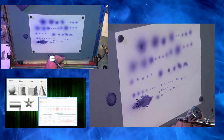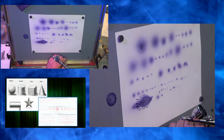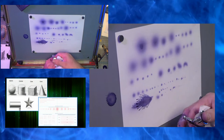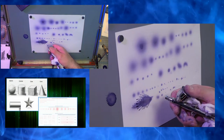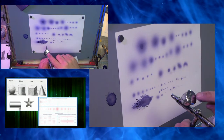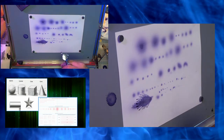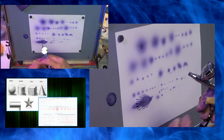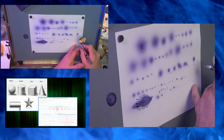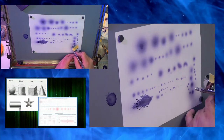Another issue that a lot of people overlook, this is issue number 5, I would say, on the list. Right here, okay? I do this a lot where I put my finger over the vent, and I shake it, okay? And over time, paint will build up here. I'm going to simulate this, see if we can catch it on camera. I'm just going to block this off. And we'll paint for a bit. And everything's fine. For quite a while, actually.